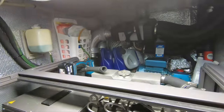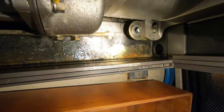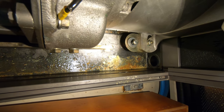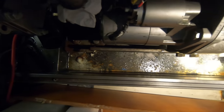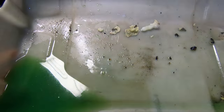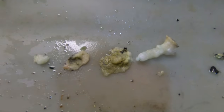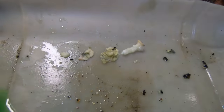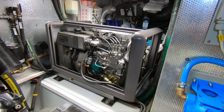I've got the heat exchanger out. That was one end — a big rust and salt pile. And that was the other end — big rust and salt pile. So obviously we've got a leak on the heat exchanger. We had salt crystals in the bottom of the generator — salticles. Not good. Luckily, last time I was in there I had coated everything in grease, so once I wiped the salt off, nothing was too damaged underneath. Thank goodness.